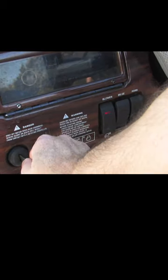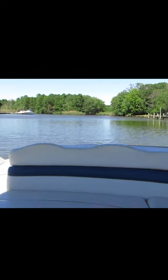That's why all inboard outboard boats are equipped with fans, and you have to turn these blower fans on before you start the engine. You're supposed to have them running whenever you're running at low speed. I know lots of people say they never bother, but you should be doing it so that your boat doesn't blow up.